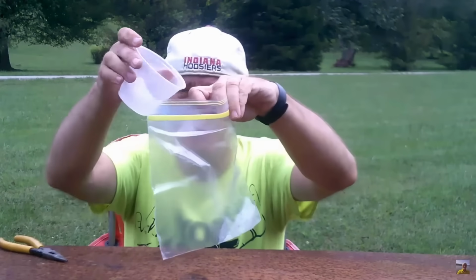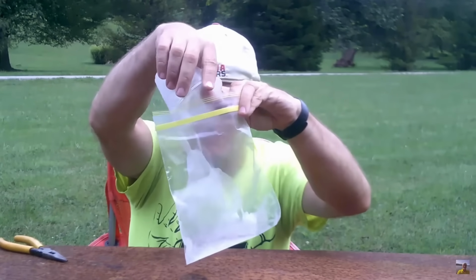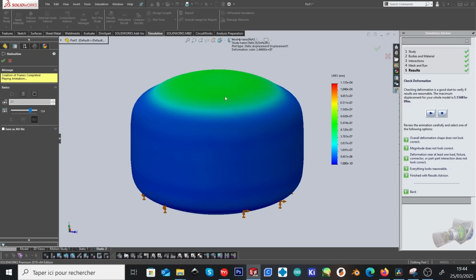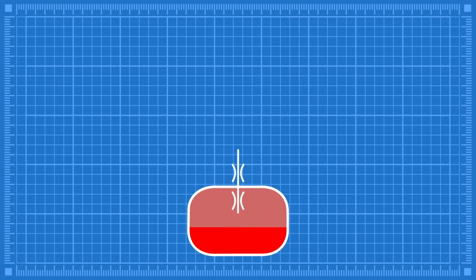You see, the butane inside these tanks is actually in liquid form. The liquid butane is able to partially evaporate and fill the empty space inside the tank, and at room temperature maintain a pressure of around 2 bar. Once gas is allowed to escape through the top, the pressure inside the tank plummets, enabling more butane to evaporate until the vapor pressure of butane is reached. To get a stronger jet of gas, we could increase its vapor pressure by raising the temperature inside the tank.